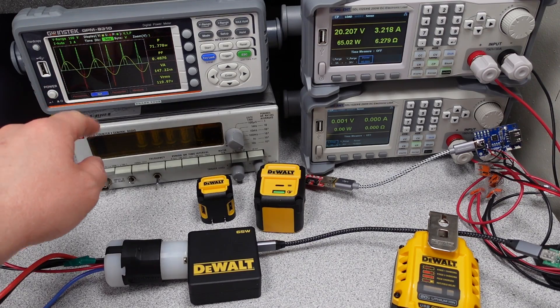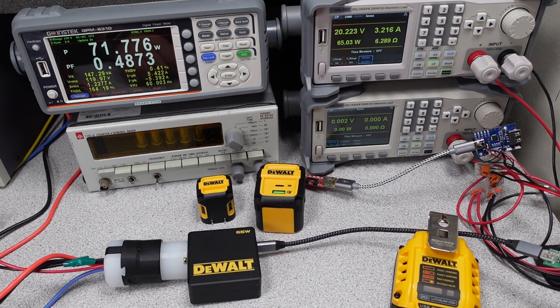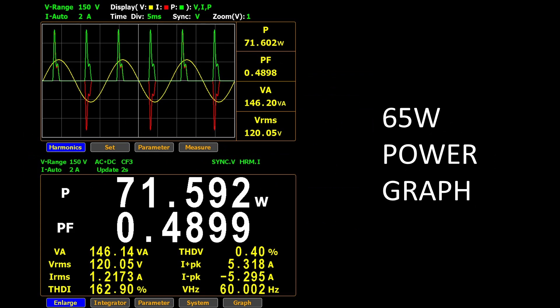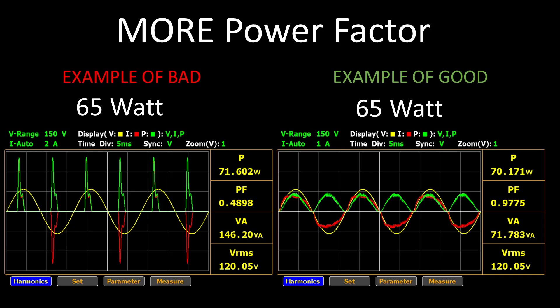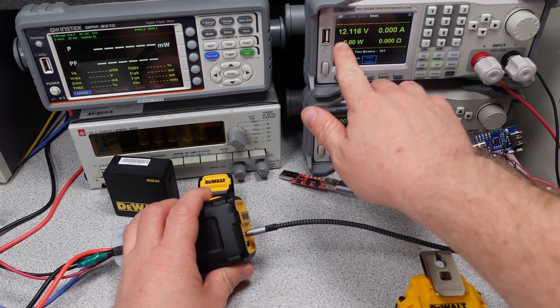The 65 watt adapter is the elephant in the room for power factor correction. If this channel does nothing else, maybe someone will make a 65 watt adapter with PFC. These adapters don't have it. On lower wattage it isn't expected, so these have rather large peaking graphs, not following the sinusoidal shape that would be ideal. Power factor correction is a technique to consume AC power as effectively as possible — the higher the power factor, the lower the comparable current, and therefore the lower the loss in wires and transformers. The 65 watt adapter is absolutely pathetic compared to a PFC-enabled adapter of the same wattage. With electrical rates getting more expensive, the difference for just this adapter can be $3 to $10 per year at 2022 residential rates, assuming it's always charging something.